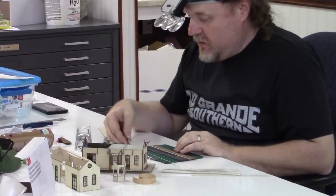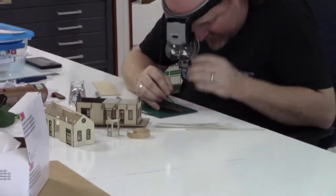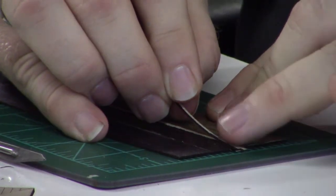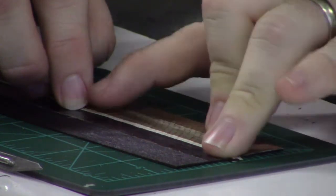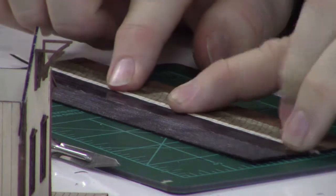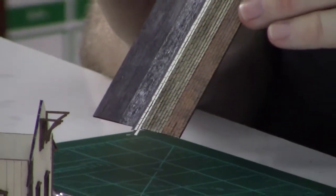So when you get ready to do the next row, I'm literally doing the exact same process. I'm getting it up here. I'm holding it between my two fingers and my thumb. I'm gonna get up on this edge, put my eyes back down where I can see. I'm gonna offset my tabs. Press it in place, come down a little ways, press that in place, come down to the end. I'm looking down the end too as well to see if I'm keeping straight with my lines.